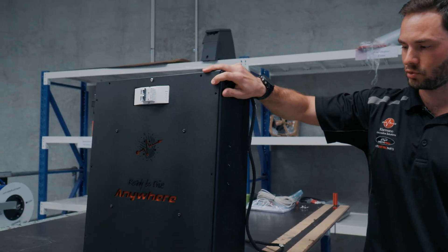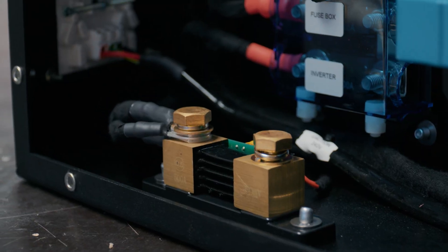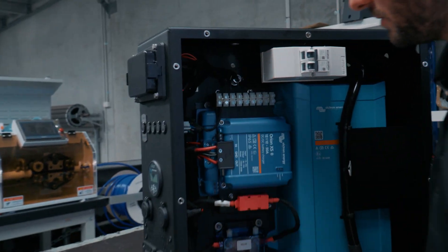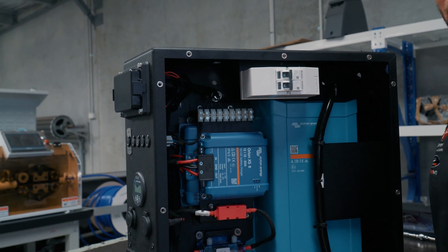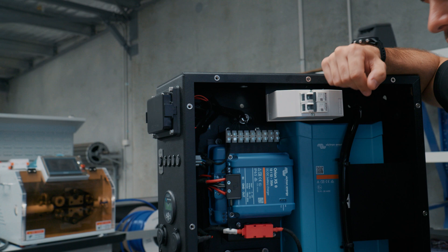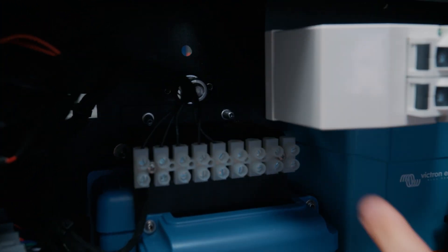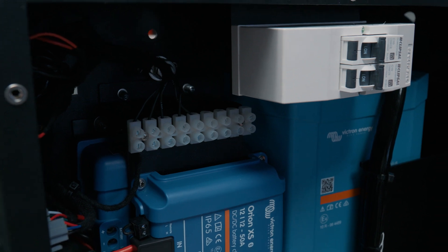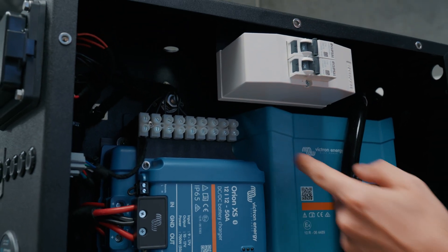So we'll pull this cover off and check out what's inside. At the top here we've got our junction stud — this is a negative junction stud, it's connected to the Smart Shunt. We've installed that just to make easy installation of all your accessories, because you'll either be running to the fuse box up top or this terminal strip, so you don't have to run all the way down to the Smart Shunt. Just below that we do have the terminal strip. We've already pre-wired the five switches so they just go to the terminal strip, they're already fused for you — you just have to connect your output wire to your accessory. There are also a couple of spare terminals down there, so if you ever had to join wires together you can just do it through the terminals.